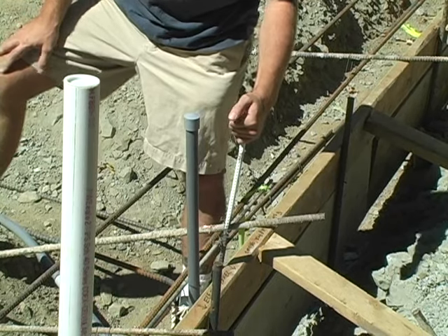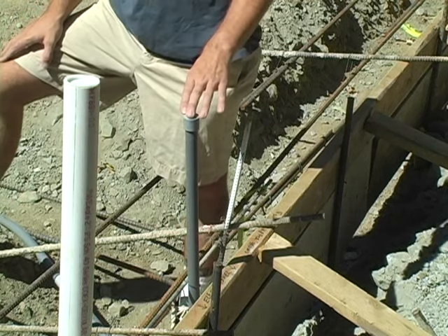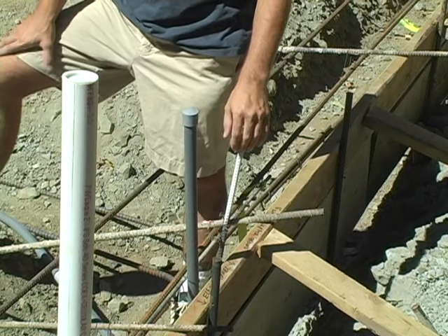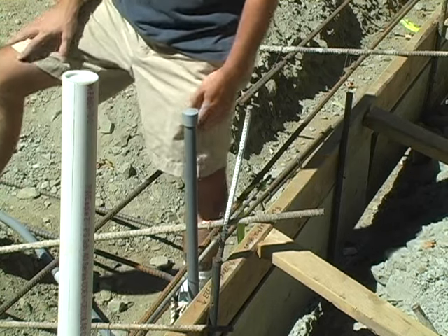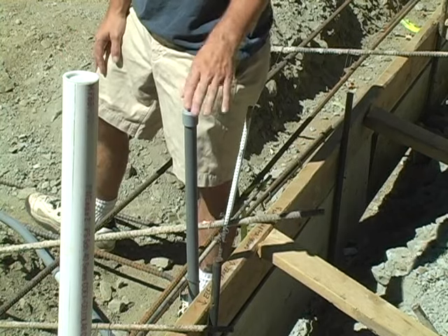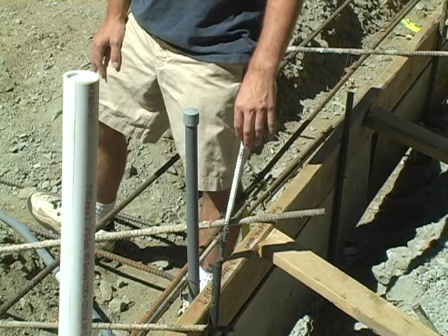This needs to be in place before we pour the slab. We've also run a piece of conduit here that will run out as a home run to the electrical panel down in the slab. We can also go up the wall and out into the roof line, but there are some places where it's actually going to be easier to run as a conduit down through the bottom of the slab. This doesn't have to end up buried too deeply — it just needs to go down and be out of the way of the insulation and other materials so we can keep our insulation flat before we do our pour.